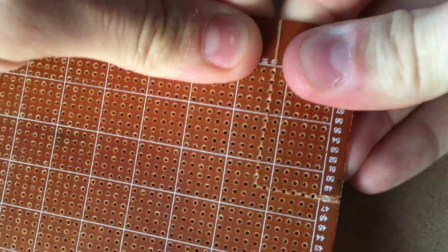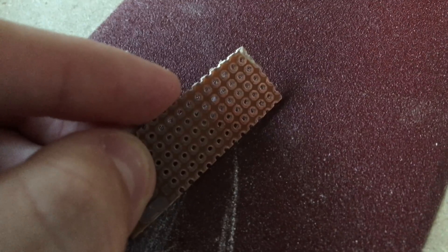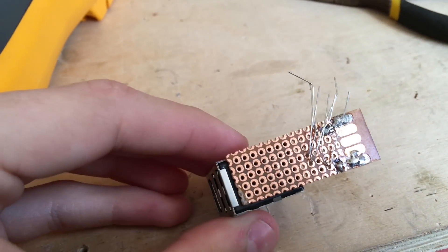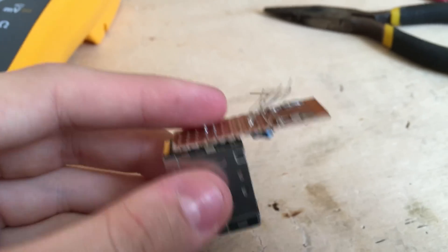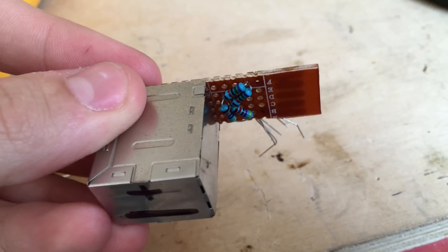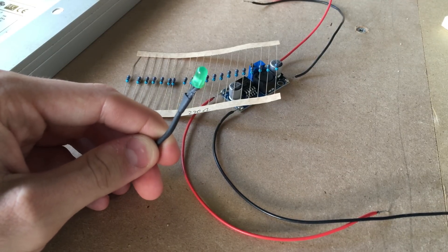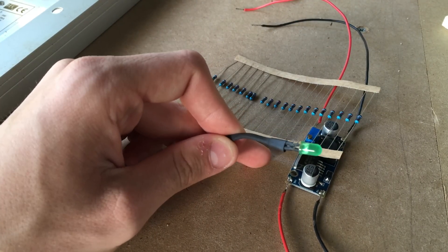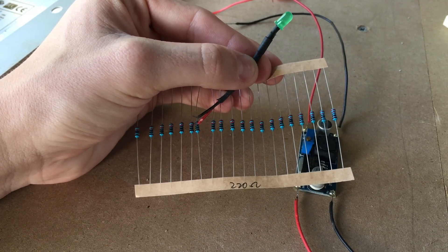Score the board, then snap it out. Don't forget to sand down the rough edges of the perf board. This is what my setup looks like before I've soldered it all together — the board comes most of the way to the edge of the USB port, sticking out the back, with four resistors in place and the positive and negative power pads on the right. I want to add a little green indicator LED to the solar panel so I'll always know whether or not it's charging, and also remove the blue indicator LED from the DC-to-DC buck converter. Running the calculations, we come up with a 220-ohm resistor required if the input voltage is 5 volts.